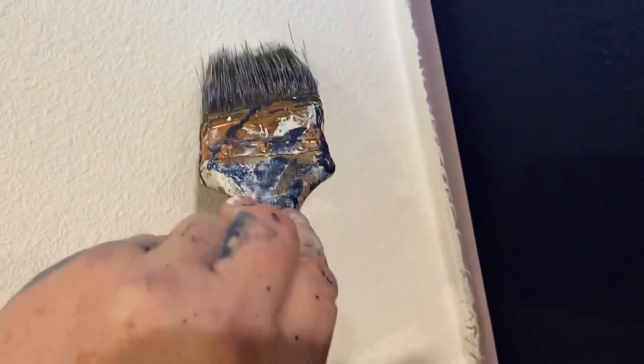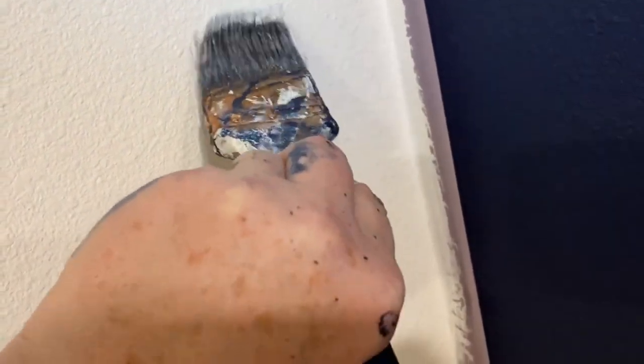This is where you would want to use clear. That's beige paint on the left, obviously blue on the right. So you want to use translucent caulking. It goes on white, dries clear. Therefore, it's translucent. It will not inhibit the brilliant navy blue color on your right, nor will it make the paint on your left look darker or lighter.